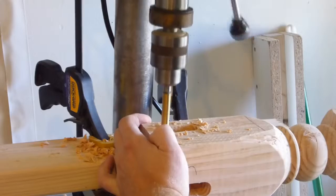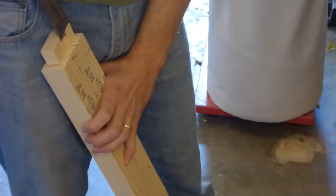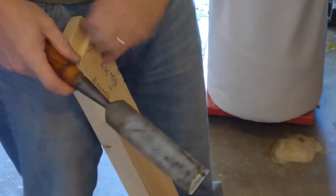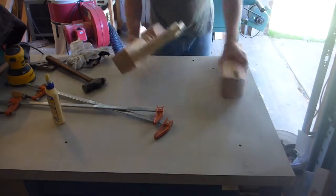Once the mortises in the legs were cleaned up, I could sneak up on the perfect size for the tenons. A few of these were more of a stumble past than a sneak up on, but everything ended up fitting together snugly. Here's some shots of me trying not to be frantic while gluing it all up.